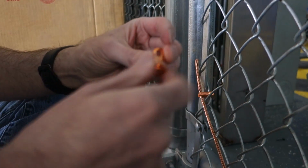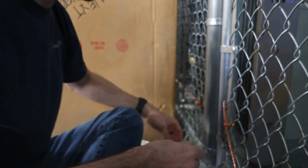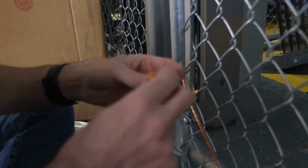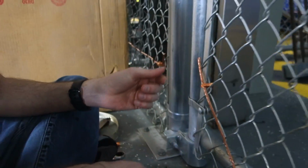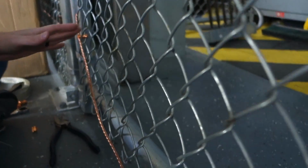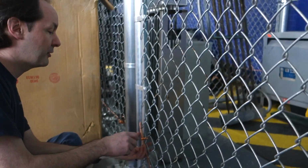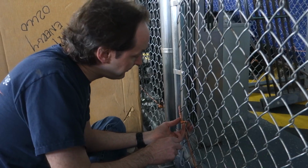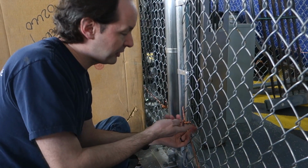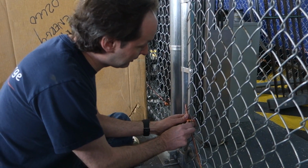They're also the absolute crappiest quality I've ever used in split nut connectors. I don't think they're actually copper, I think they're copper plated at best. Most of the time, they either form a really strong mechanical bond or they break right off. I've had a few where you have to be careful over tightening these. And they use up a lot of space in the nut for the clamping, so you don't get as much depth in there as you think.